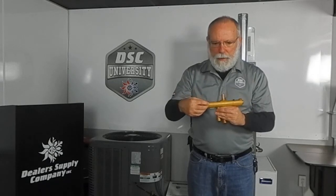The slide is made out of steel. What I have here is a couple of rare earth magnets, and these magnets will stick to the steel on the inside. So I can take them and place one on the reversing valve here and one on the reversing valve here, and that actually allows me to see the position of the slide inside of the reversing valve as it moves back and forth. I can actually see if that reversing valve was stuck in the middle because my magnets would not be at one end or the other.